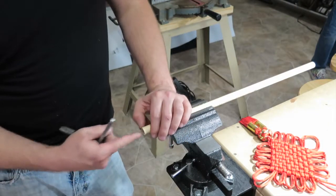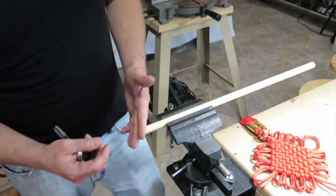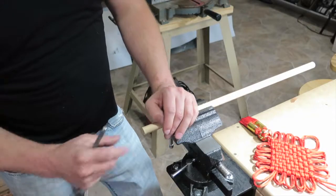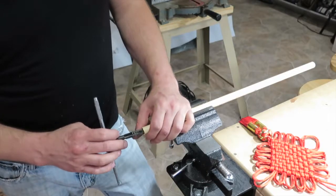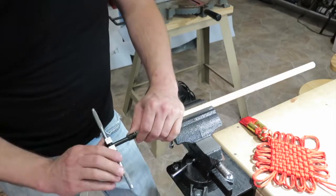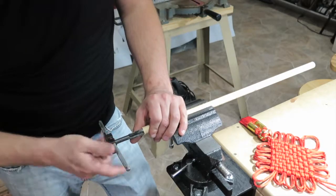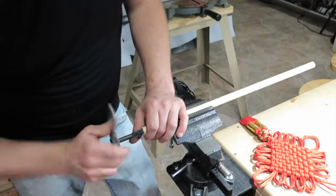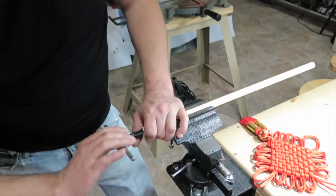It's plastic. We need to thread a piece of plastic or a bolt with a hole in it or something in here to attach the tennis ball to the top. It has to have a hole in it so some strings can pass through, which will actually activate it. I think I'm going to be able to capture enough thread for that to happen. This is a half 13 tap. I think I'm going to be able to get just enough thread to hold a tennis ball on. That's real close to the diameter anyway.